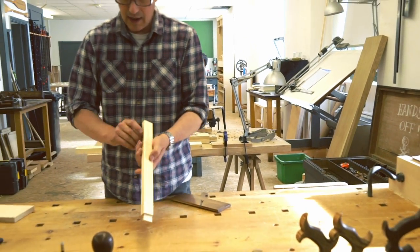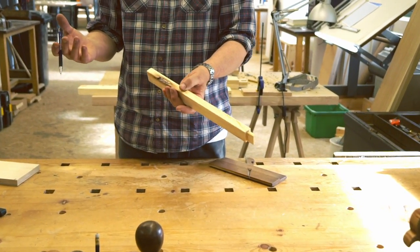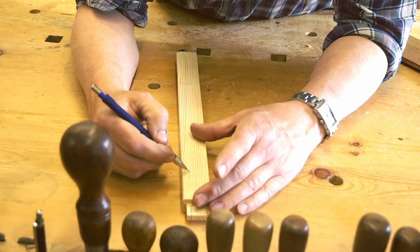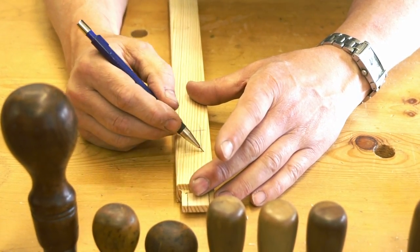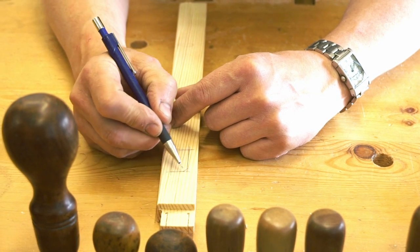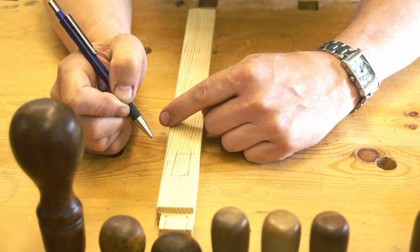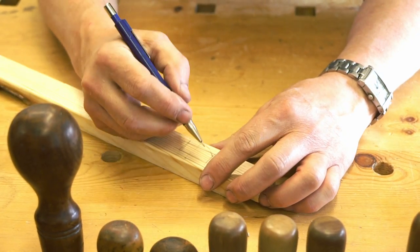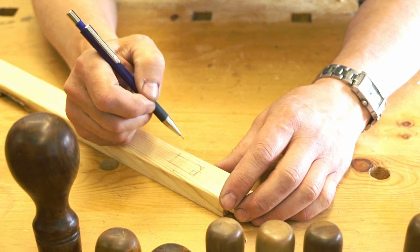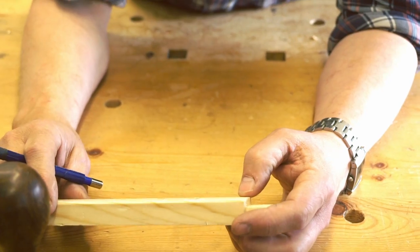What I've done there — if you look — I've just put a segmental curve on, and it's nice and even front to back. I could do four of those all the way around. But it's worth experimenting with and playing around with how things look. What you call a segmental curve is just part of the curve. If I did that full curve, it'd probably come down like that — that would be the quadrant. I like it, I use them quite a lot. But if you wanted to do a more blended curve where the radius is inside, you can do both. You could do a segmental curve on the top and something more rounded so it's comfortable underneath — whatever floats your boat.